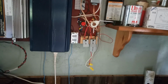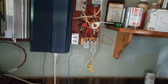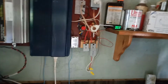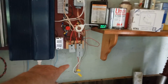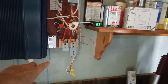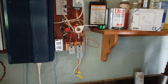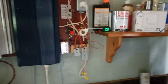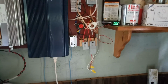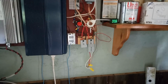These replaced a QS60 switch that I had, which shorts out. I'll come up with something different later, but yeah, I move it over to one side, and the 60 volt array is in parallel with the other one to give me really good morning sun. And I can put the panels in series to run the washing machine when needed. And that only happens from about 10 o'clock in the morning till I don't know, 11:30. Actually about 9:30 you can start.